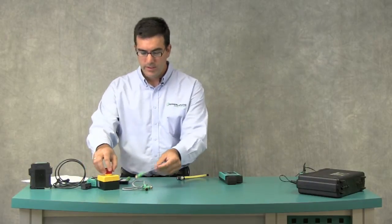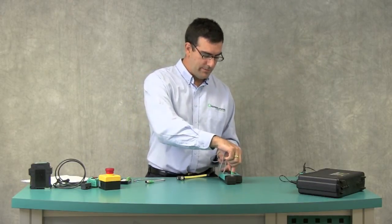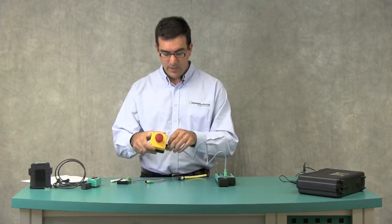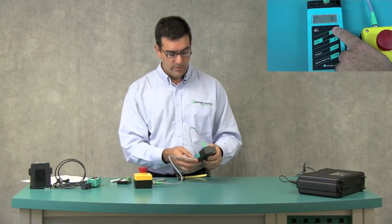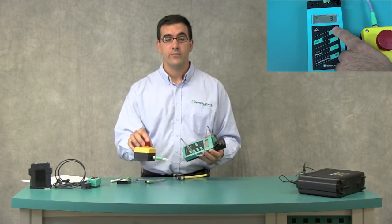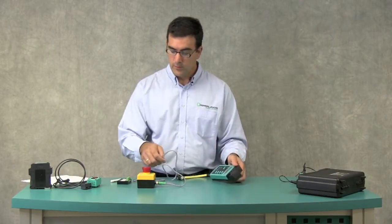The next one I want to show you is the M12 extension cable that's included. This is the same M12 male connector that you put directly in the top of the handheld — it just pushes on, there are no threads. You can then attach it to any module that has an M12 on it. This is an e-stop, and it has a full address, so it needs to be 1 through 31. I'm going to make this address 3. You can see I arrow up to 3A, but it's going to automatically know that it's a full address module and change it to address 3, not 3A. And it's made — very simple.